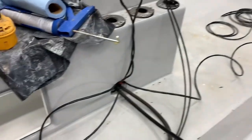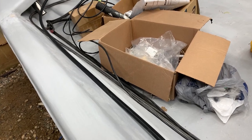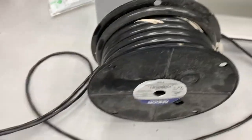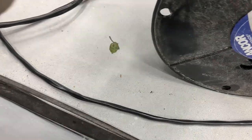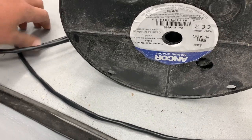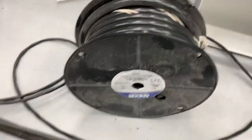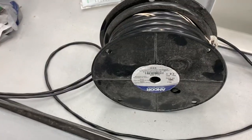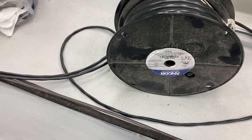We're going to start the wiring. I've already done a little bit and it's a mess right now — just laying everything out and trying to remember everything I need. I've got everything labeled so when I get up in the console it'll be easier. I've got a 150-foot spool of marine grade number one wire. I measured the length, estimated the amps for the motor, and the hardest part was figuring out the amp draw for the starter on a 60 horsepower 1996 Johnson. From everything I read, it's 150 amps, and for that footage — only about 12 feet — number two was the minimum.